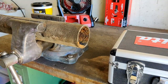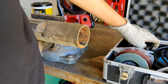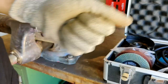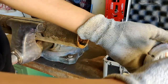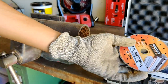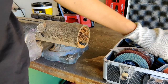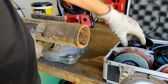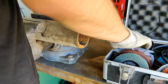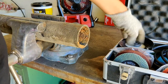Now let's try out using an angle grinder. Just like with the reciprocating saw, you'll need a heavy duty professional grade model — a DIY angle grinder will not be up to the task. I like using diamond metal cutting blades. Here are two different brands, not to be confused with diamond masonry blades. I feel these blades are safer because there's no risk of flying debris if it breaks, and it fits any standard angle grinder.